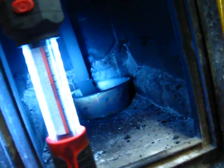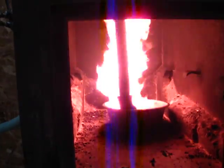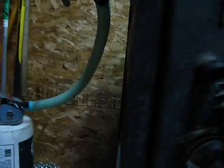You've got to light it with a little bit of kerosene. It's been running, so it's kind of warm. I'll fire up this blower and turn on the oil drip. You can see right away there's a nice flame. I'm just going to close the door and let the kerosene burn out, and then you can see it just running on oil.